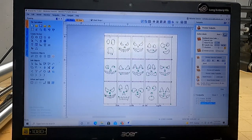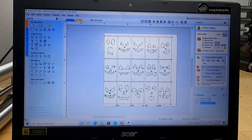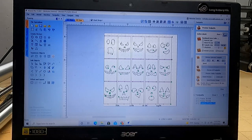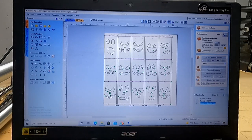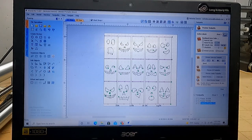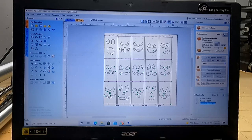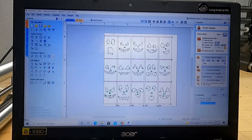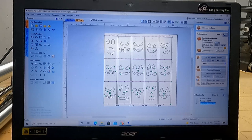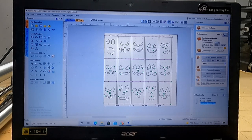If you look here, this is for the Onefinity Woodworker 32-inch working space. This is one picket here. This is another one here, here, here. So it has a total of 5 pickets. And I cut them at 31 3/4 so that I'm not fitting end to end. My spoil board's inset a little bit, so it just saves me that. I usually secure it with a screw here and a screw here.